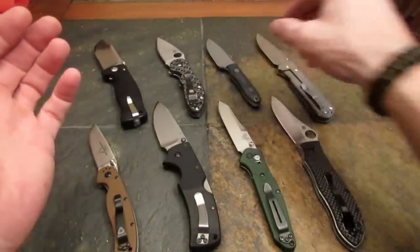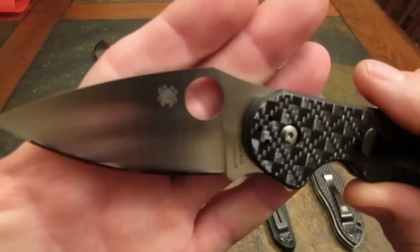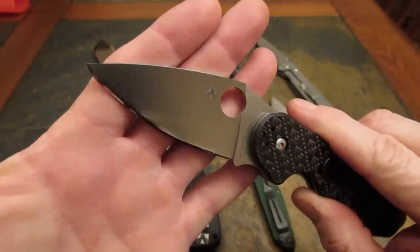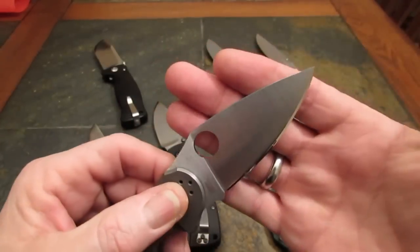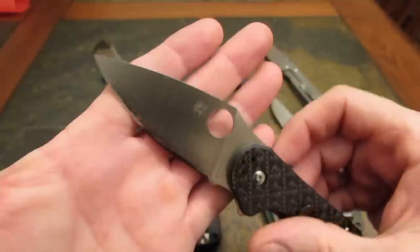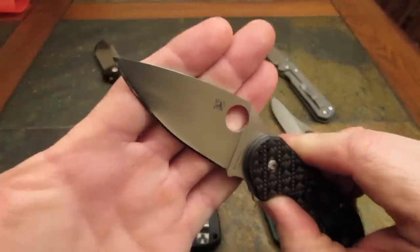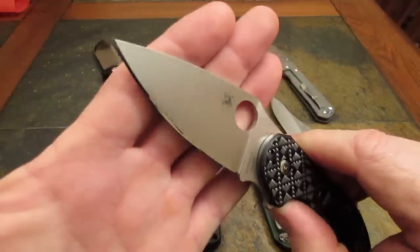Number two in initial sharpness and consistent edge geometry — the Spyderco Domino. Once we got past the Davis, we've ended the list of knives on this table that didn't have to be resharpened immediately by me. This was pretty darn good — if you watched my initial sharpness review of the Spyderco Domino, you saw how sharp it was out of box. It wasn't a sharpness or geometry issue, just a level of polish preference. Excellent edge geometry. Spyderco does a 15-degree secondary bevel with a 20-degree micro, and this knife was right on the money base to tip.